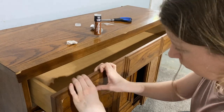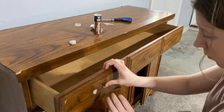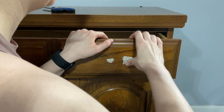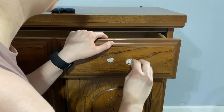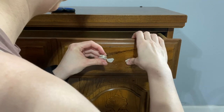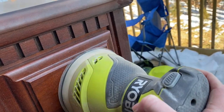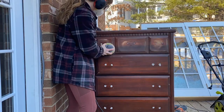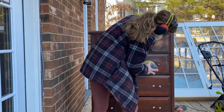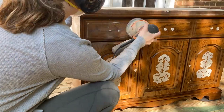I like to use quick wood to fill in old handle holes, as I found it to be very durable and reliable. You can also use regular wood filler or putty. Make sure you slightly overfill the holes, as the wood filler can shrink as it dries. Wait the time recommended to make sure it is fully dry before moving forward. You will want to sand down these areas to make sure they are flush with your surface. I would recommend using a slightly higher grit for this — I wouldn't go any lower than 150 grit for this step.